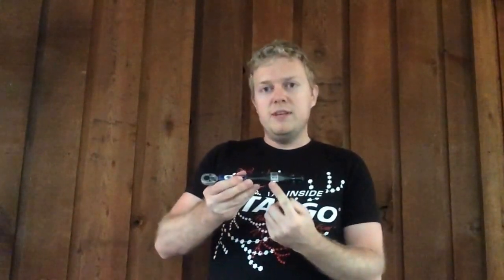It's a very distinguished click, so you know you're there. It has a really nice, easy-to-read torque window, so you can see exactly the amount of torque you've dialed in. It has a nice, easy-to-turn adjuster knob, which allows you to adjust the torque down to 0.2 of a newton meter — especially handy when working on bikes such as Specialized, who spec their seat post collars at 6.2 newton meters, so you can make sure you have that dialed in with this tool.